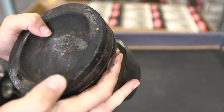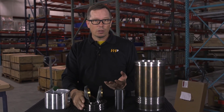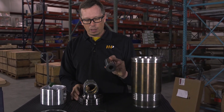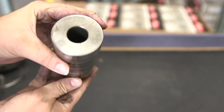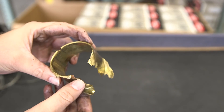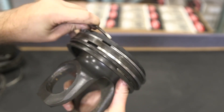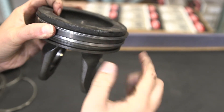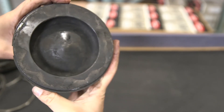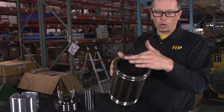You could see overheating on the bottom of the piston crown if your piston cooling nozzle isn't pointed in the right direction or isn't supplying enough oil. If you've got a malfunctioning injector, you can have everything from scored cylinders to eroded pistons — sometimes the top of the piston is completely eroded and melted. In cases of lack of lubrication, the wrist pin loses lubrication and tears up the bearings, the piston crown bushing, and the top of the connecting rod. You may also see broken rings.